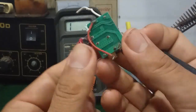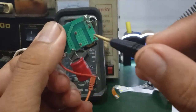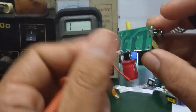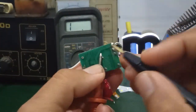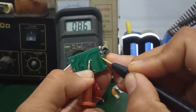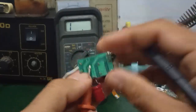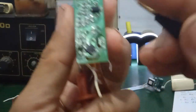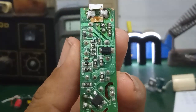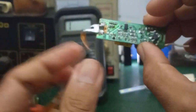In contrast, a standard LED driver board just has a single coil with 2 pins connected together — you only measure continuity in one direction. The two pins on both sides are connected together. But here they are separate: 2 long pins and 2 short pins, corresponding to the primary and secondary windings of the flyback transformer.